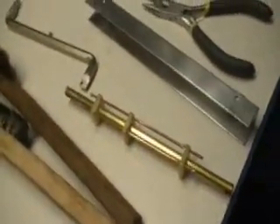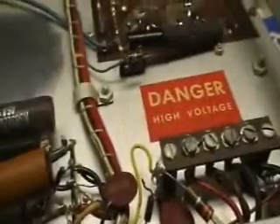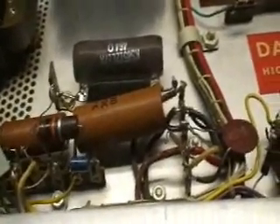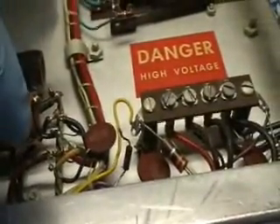We'll go ahead and mount that up. I took the SWR bridge out, cleaned and polished it up, and need to go ahead and reinstall that. The germanium detector diodes — I moved those out of the way very carefully because I didn't want to have to get new ones. Micro Semi actually still makes those so they are available. They're pretty fragile; I think they're 1N191s.